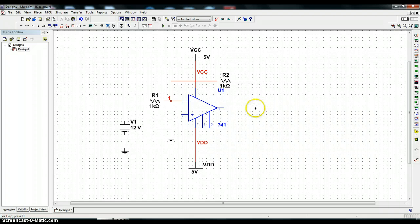Now you can only make that one turn without having to click again, but at this point I click again, and now I can move over to the output of the op amp and click again, and I have connected that resistor. Let me do the next several rather hurriedly so I don't run out of time. So I'll do this one, click, and I need to connect the ground here. By the way, the ground always becomes node 0.